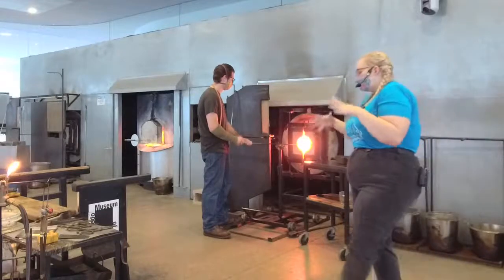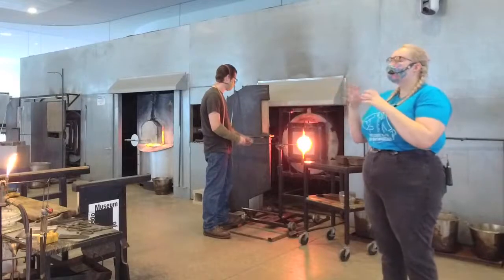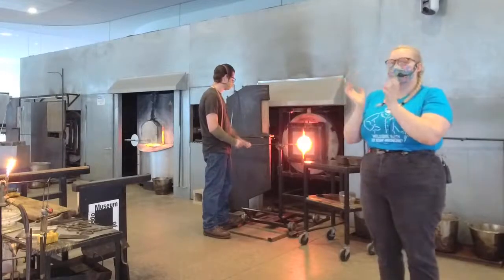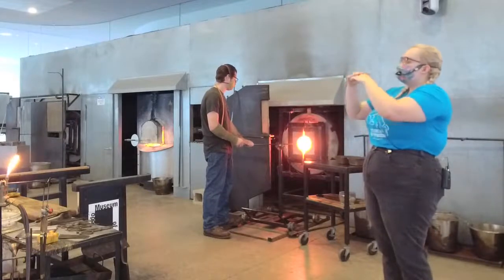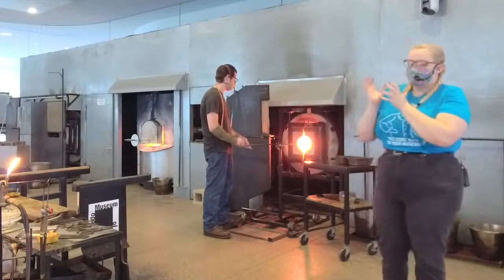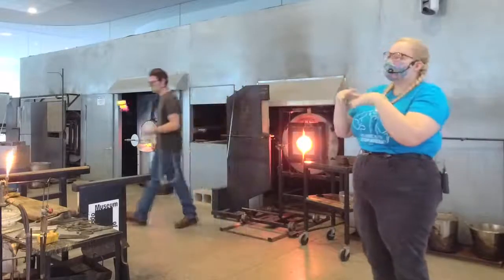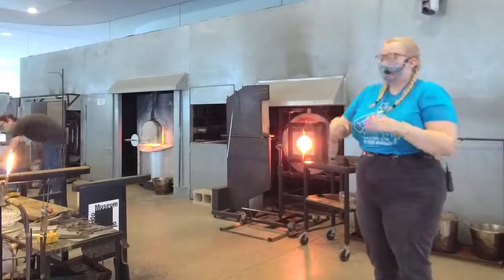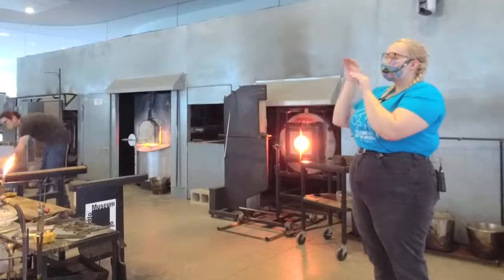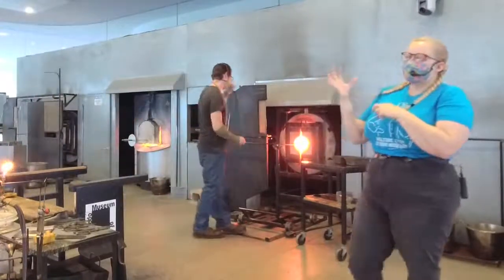Misha's picking that bar up and heating it. Today we're going to do something called an overlay. In order to get that color all the way throughout the glass, we're going to take that little chunk of bar and physically place it over the top of our glass bubble. If you were to buy one of the pieces we make in the studio, you'd notice there's just a razor-thin layer of color.